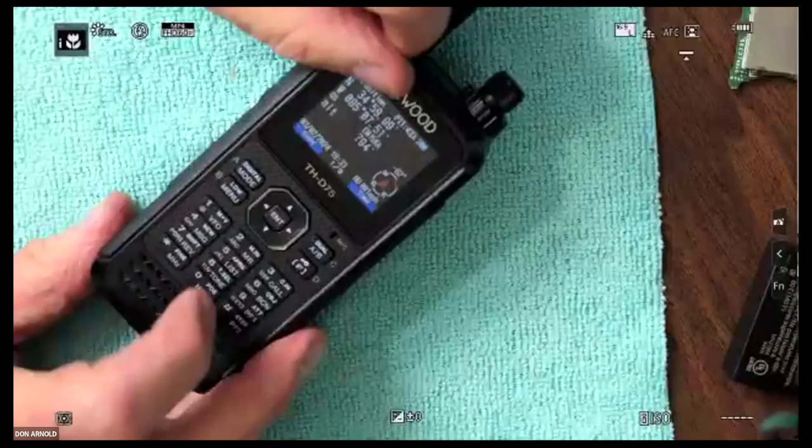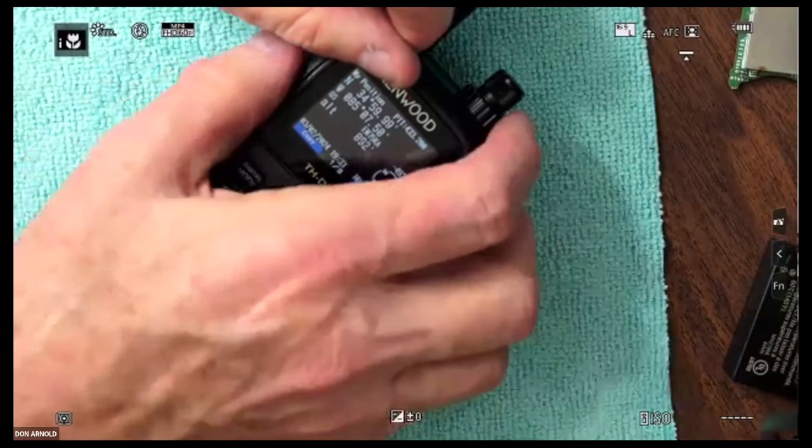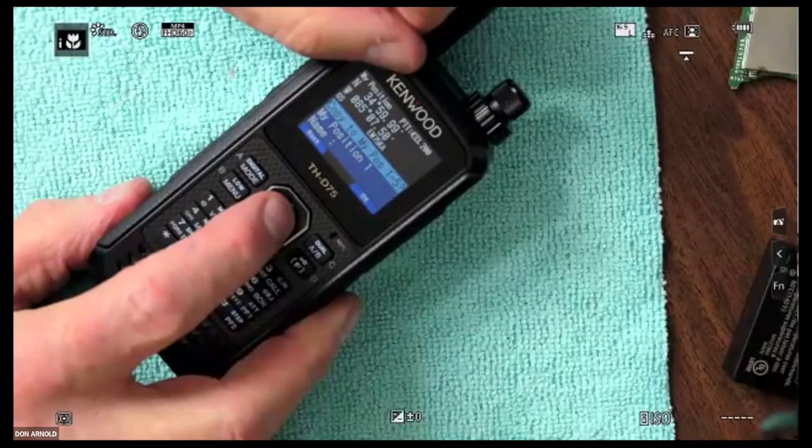Let's go down to function mark. Function. My position, latitude, north, 34 degrees, 59.99 minutes. Longitude, west, 0, 8. Then my position, choose your position one, name. You can save it directly from the GPS. Hit enter? Yes, if you want to go to 1, hit enter.